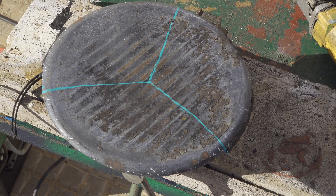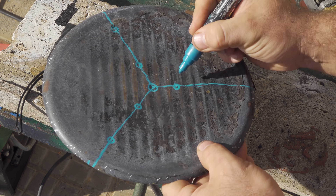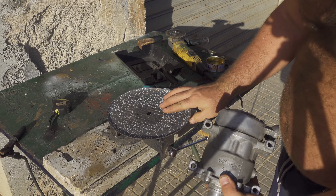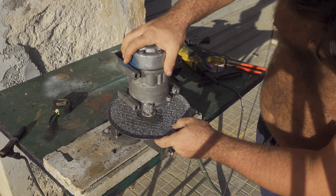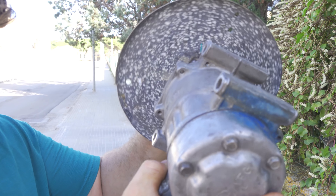Let's take a very old and rusty kitchen pan, remove the bottom part using a grinder, divide it into three parts, and mark six points where I can drill holes. This will be the part where I can secure the PVC blades in place. I make sure everything is straight and centered, then weld the parts together. I will connect the compressor to this plate and make sure everything spins freely without a lot of friction.